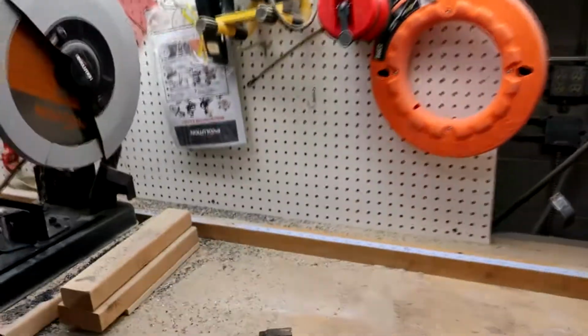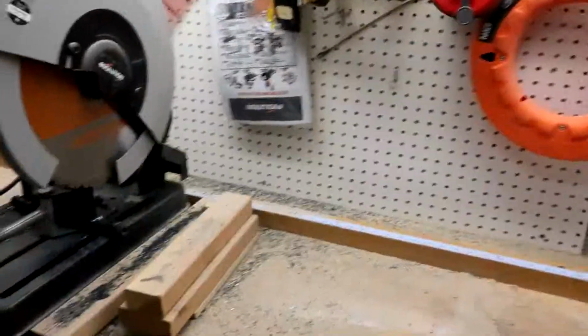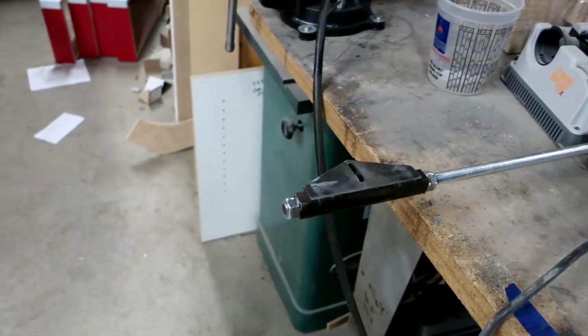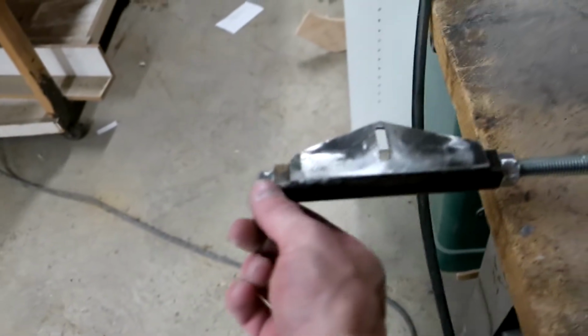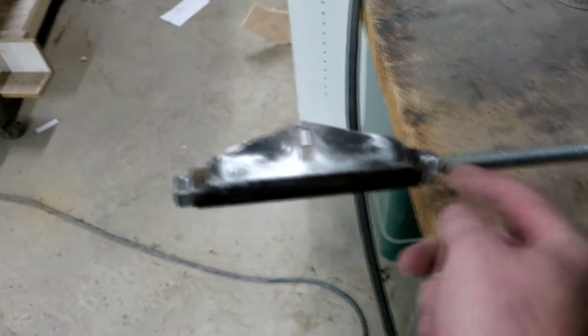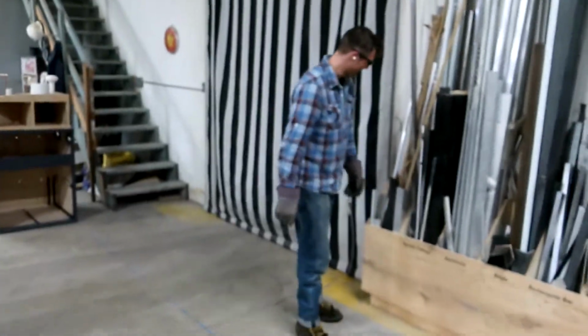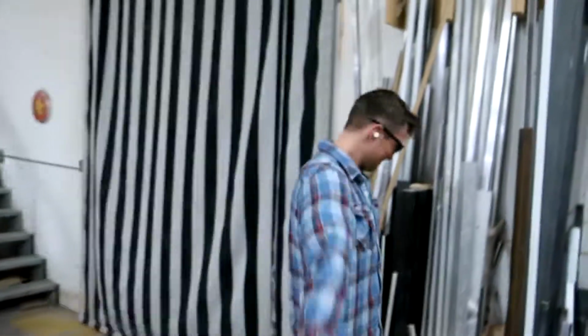There's chips. Yep, it's cutting. Yeah, it's doing its thing. That is definitely an indication of stuff being cut. So we're using this threaded rod to hold the nuts in place, and once we weld it, we'll just back the rod off. Or that's the idea. Hopefully, you didn't weld the rod to the nuts, did you, Riley? I can promise nothing.